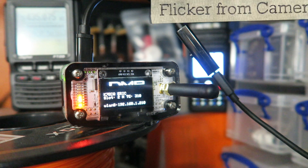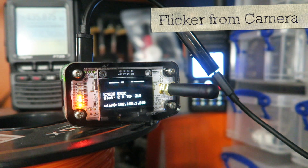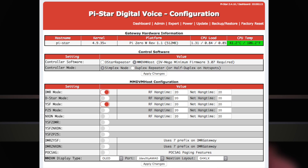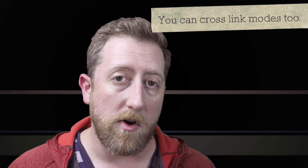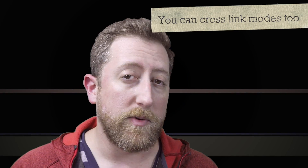The ZoomSpot allows that. What's nice about the ZoomSpot is that it has a screen displaying what modes you're receiving or transmitting on, which is great if you operate multiple modes relatively simultaneously or scan through different modes looking for activity. The ZoomSpot itself is capable of doing DMR, D-Star, Yaesu System Fusion, P25, and NXDN. And for those so inclined, it also does POCSAG if you want to get into pagers.